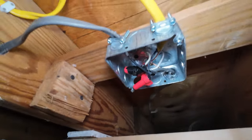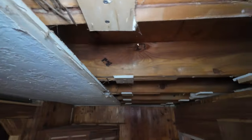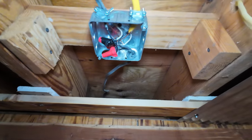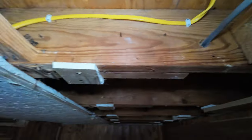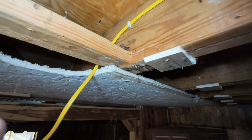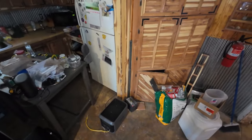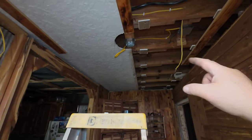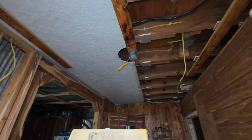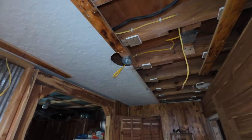On to the fan box. I had a momentary lapse of confusion — I was thinking about switches, but the junction box has nothing to do with the switch. Switches come off the actual lights or fans. I'm kind of working backwards today. I had to take that piece of metal off because I need to run a new wire for the new switch, and the existing wire barely reached into that box. I can't get the cable loose because it's tied right here.